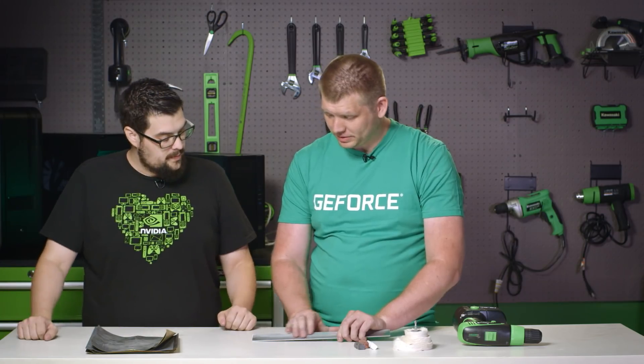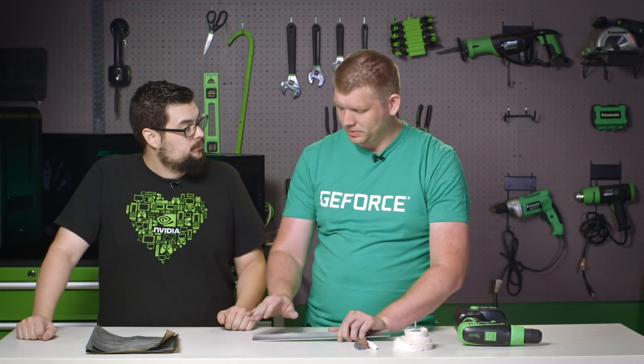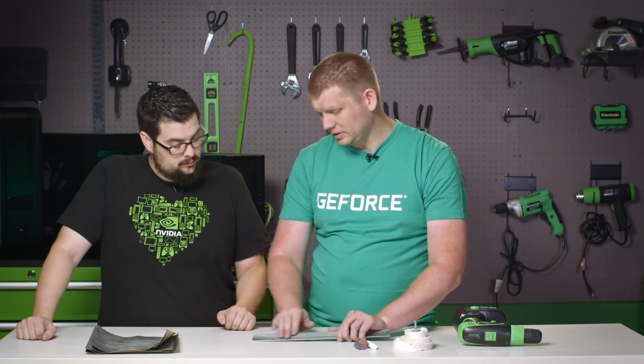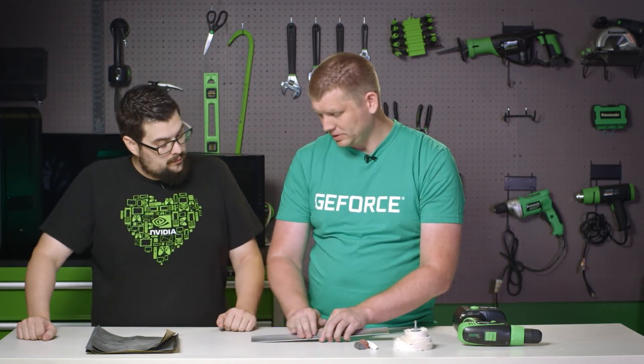To get a polished finish, we start with a raw piece of aluminum and begin with 600 grit sandpaper, stepping up to 1000 grit and then 2000 grit. We want to sand for a couple of minutes on each grit to get a very fine finish. We could wet sand it — wet sanding is the preferable method since it lubricates the sandpaper and lets particles fall out through the water — but here we'll just do a dry sand.